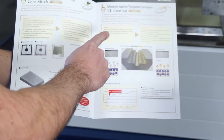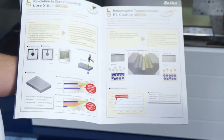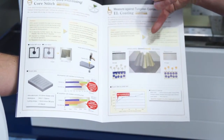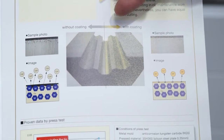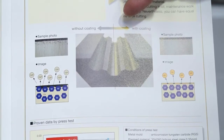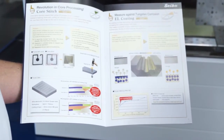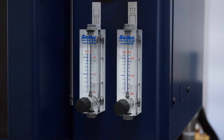Onto the EL coating — this is another area that we need to explore. The EL coating, on the last cut, will coat the part with some brass off the wire itself. This protects the surface of the carbide, stopping the cobalt depletion which can have the effect of weakening the material.